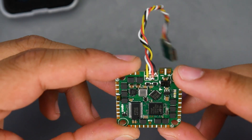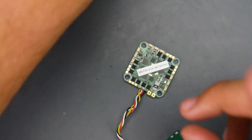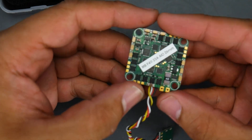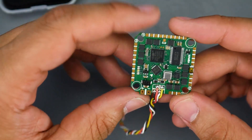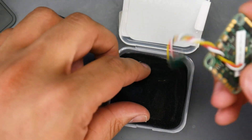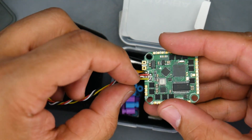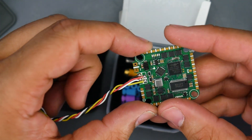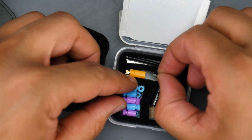It also has on-screen display as expected. I wasn't sure about a 9-volt regulator — checking now — it actually doesn't have one, but you can access the VCC for your video transmitter if it doesn't take 5 volts, and at least it's already routed. Looking at the packaging, this comes in USB Type-C, though you can desolder and swap to micro USB — the pads are big enough, just be careful with the two closest components.